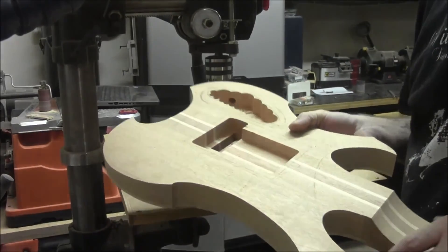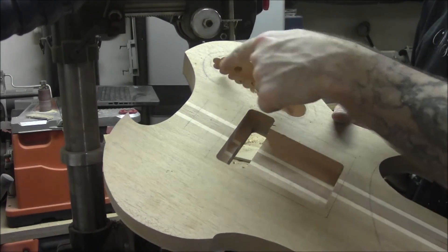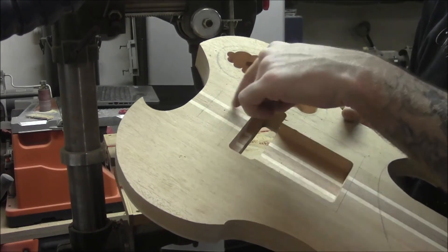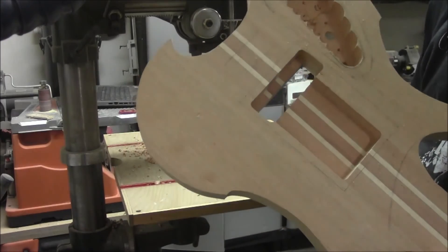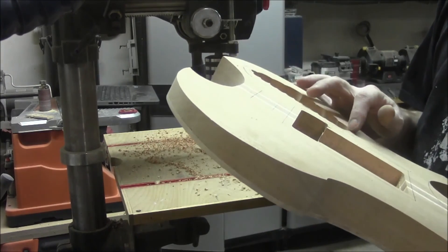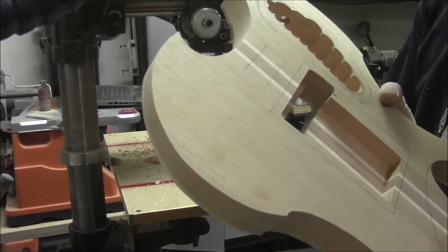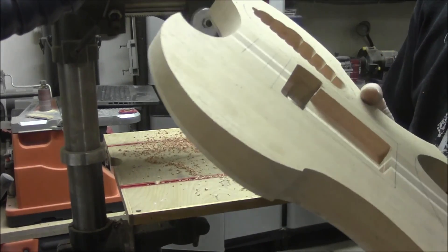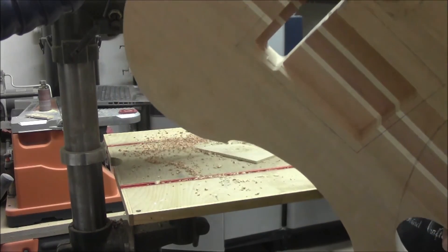As you can see, we've got most of the stuff hogged out. I had to change my boomerang design because the tunnel I had routed to go to the battery box didn't quite reach in there, so I decided to change the design — it's just going to be straight across now. Not a big deal, didn't lose a whole lot of material. We'll take a router bit and freehand around here until we get a shoulder about a quarter inch deep, then use the guide bearing to run around that profile and transfer it all the way down to the full depth of the cavity. Let's get the router set up and get to work.